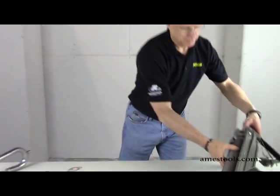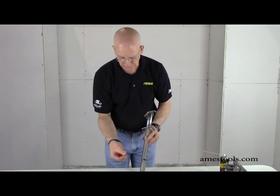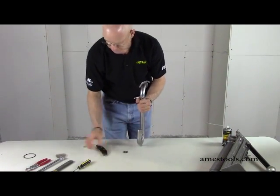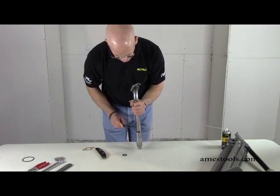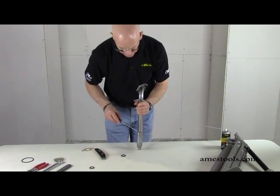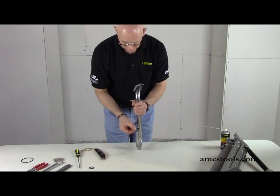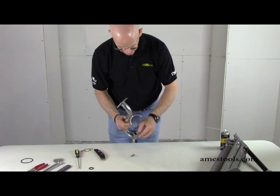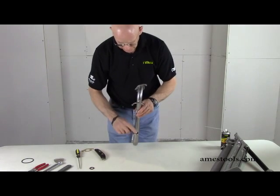Those are the main parts on the pump. There is one more O-ring on the gooseneck — it's the same O-ring we replaced on the other filler adapter, and the same way to replace it if it starts leaking. Just take a razor knife very carefully, then use a screwdriver to remove the O-ring — pop it right out and discard. Before installing the new O-ring, clean out the little seat again to make sure there's no joint compound or mud that's going to keep it from seating properly. Place the new O-ring into the seat, make sure it's seated properly, and you've replaced that part.